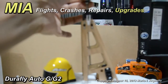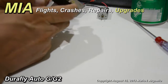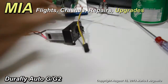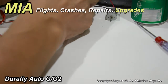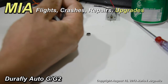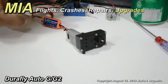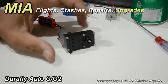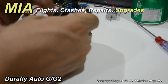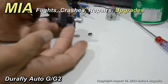I had to disassemble the auto start unit because on my particular one, after about 12 flights, the auto start switch — this electronic device attached to the motor — gave out. I went one step further and connected a speed control. I believe this is a 20-amp variable speed control, and I got it to work, but then I was getting some slipping in the flex shaft.